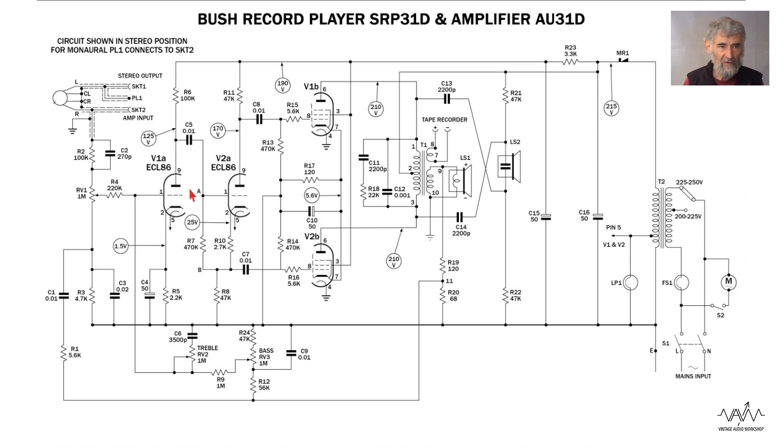After all that, what do we have? The ECL-86 is a triode pentode with a high-gain triode like an ECC-83 and a high-gain output pentode. We've got two output valves in push-pull, and we've also got two triodes — the first one is used as a straightforward voltage amplifier, and it also has the negative feedback applied to it at the grid rather than the usual cathode.